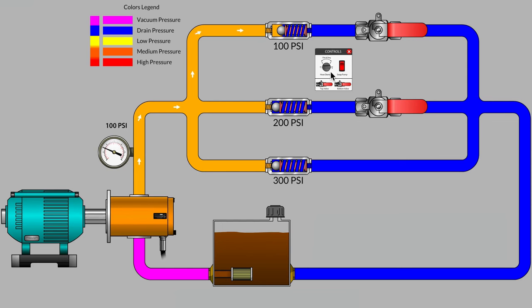Let's go to the largest size, or the more properly sized hose for this particular size pump, if all we want to do is see load pressure from the check valve. And now what we find out is we're back to 100 psi, and of course flow only passing on the 1 branch. So that's a bit of an introduction to what happens when you have more than 1 parallel flow path in a hydraulic circuit and you're expecting flows to occur on more than 1 branch.